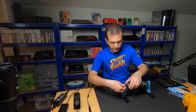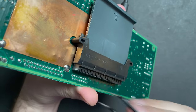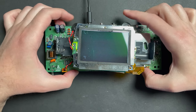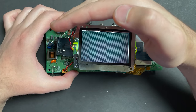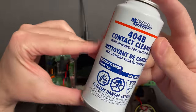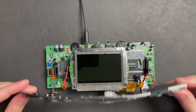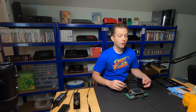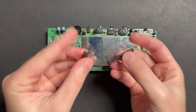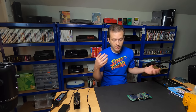We've swapped out that resistor. Let's see if that had any impact. Feed it nine volts and manually turn it on. We're getting the same symptoms as before - just a black screen. It is powering up, but there's nothing on the screen. I made a little bit of progress off camera - I showered all the ports with contact cleaner: the cartridge port and both ports for the LCD and the buttons. The only thing that's changed is that it is now turning on with the press of the button, so I no longer have to short the two pins on the back, but nothing has changed in terms of what we're seeing on screen.